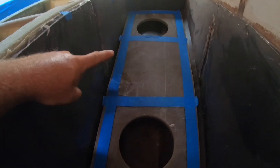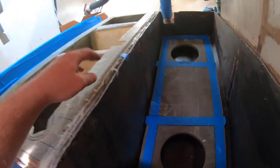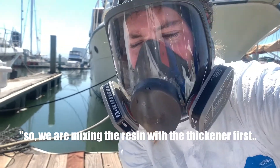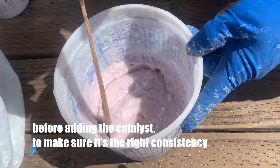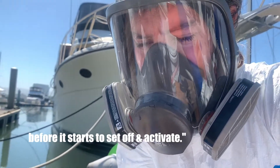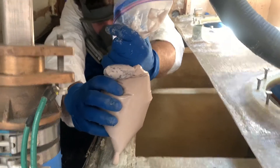I have blue tape along all of the surface that's going to be mated together, because right now I'm going to put surfacing agent on the inside of the tank lid. Then I'll make some thickened resin — it's going to go all the way around the surround and on the baffle tops. I'm waiting on the CNC machine for inspection port covers, then we'll pressure test it overnight and go swipe the credit card for some diesel. We are mixing the resin with the thickener first before adding the catalyst to make sure it's the right consistency before it starts to set off. After two full weeks of working on this project, the time had finally come to put the pieces together.